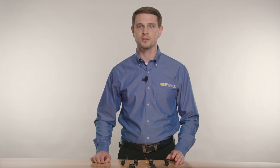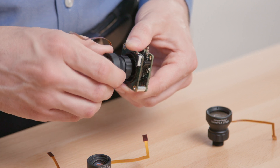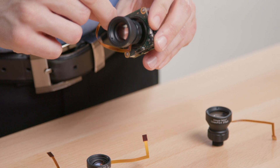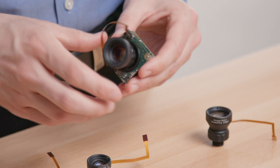Integrating a liquid lens into an M12 lens assembly allows for electronic working distance adjustment. However, some liquid lens assemblies may be difficult to use because they also require some mechanical adjustment. The TechSpec Liquid Lens M12 Imaging Lenses are specifically designed to have all refocusing controlled by the liquid lens, with no mechanical adjustment required.